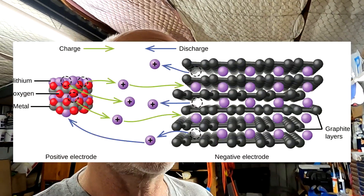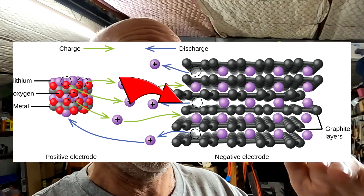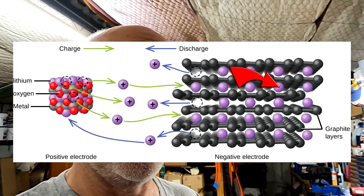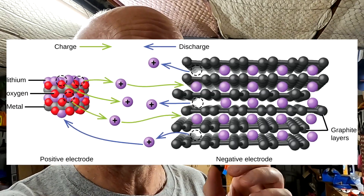So you want to compress your cells for two reasons — well, actually only one. The first reason people think is valid is to prevent swelling and delamination of the cell, which is total bollocks. In the battery, lithium ions move from the cathode to the anode. The anode consists of many, many layers of carbon material, and the lithium ions move in between those carbon layers. When they receive an electron from the electrical circuit, they become lithium atoms and increase in size by just a few picometers, pushing the carbon layers apart — and as a result, the anode expands.